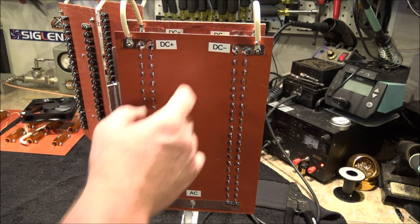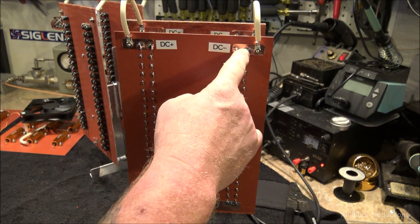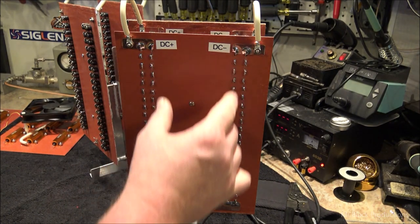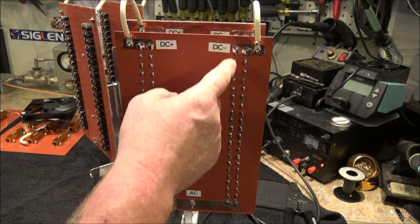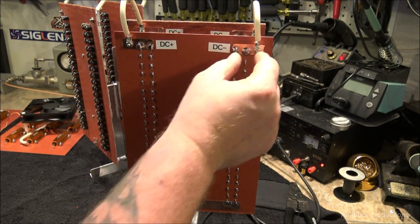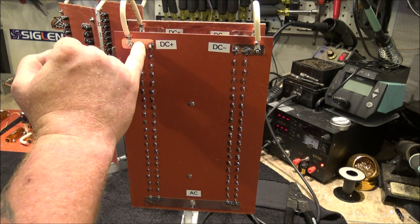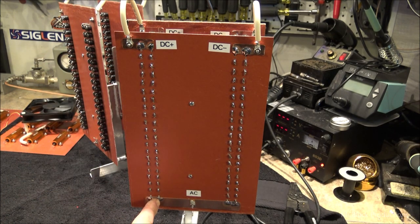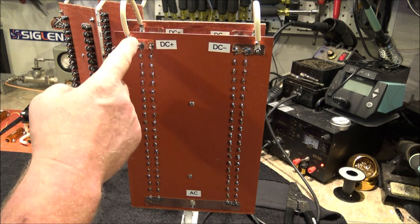But on our output side, on the DC side of things, we've now gone in the same distance, same amount of surface area, same and same on the opposite side. We've put our output side equally spaced, and that's going to be closer to this leg. Thusly, it cancels out the differentiation in distance from here to here.